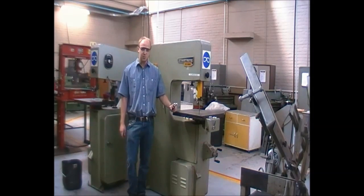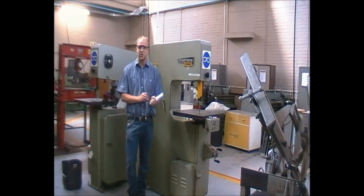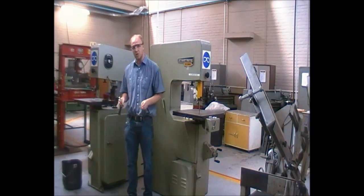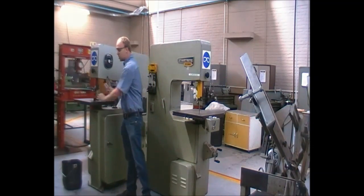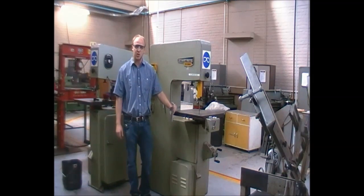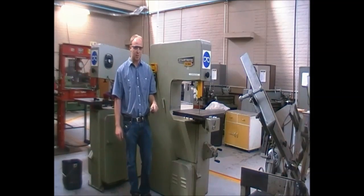Please make sure the electrical equipment is correct and you are using the correct material on the correct bandsaw. Please remove anything that can be in the way such as watches, jewellery, and loose hanging clothes. Gloves are not permitted on these machines. Ensure anything that can be caught in the machine is removed. We will now have a quick cutting demonstration after we have set up the machine.